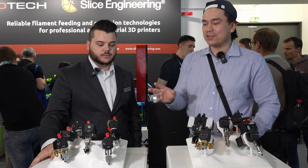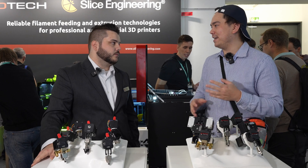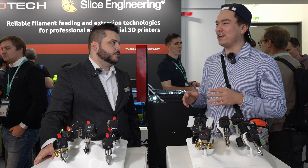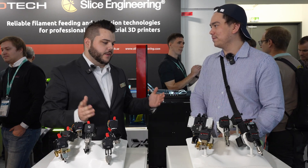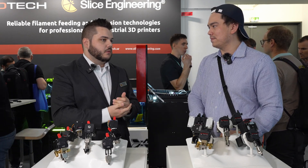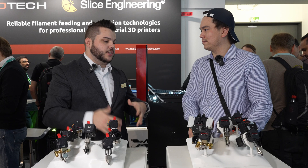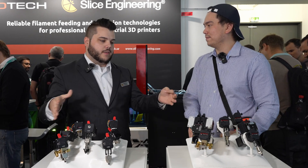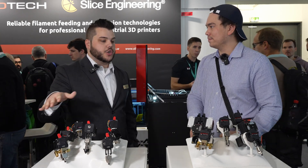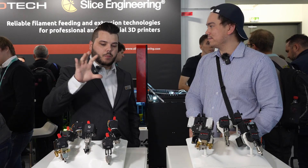One thing I've noticed is that you guys are sticking with, for the most part, circular cylindrical heating elements, where a lot of the industry is moving towards ceramic heaters. Why stick with those cylindrical heaters, which a lot of people view as old technology? I think they're viewed as old technology — obviously that was the standard when this started, and now it's becoming maybe not as standard. We still really like cartridge heaters. We're currently using them because that's what we're set up for — all of our hot ends use the same style heater you can get from us or elsewhere. As we look to the future, we're evaluating everything and seeing what options are out there, but for now we do really like cartridge heaters.